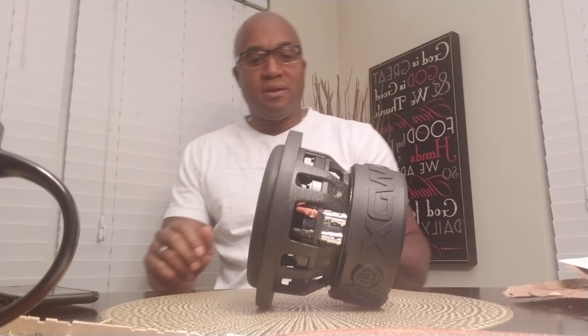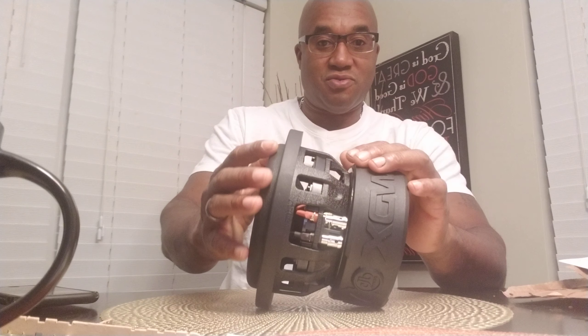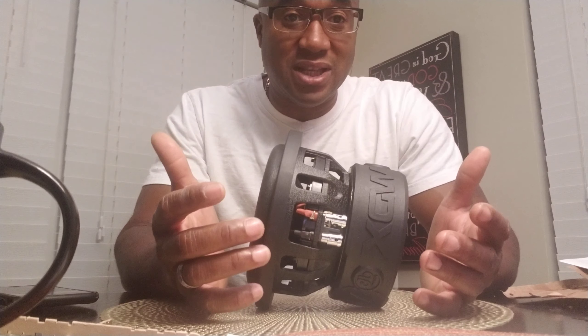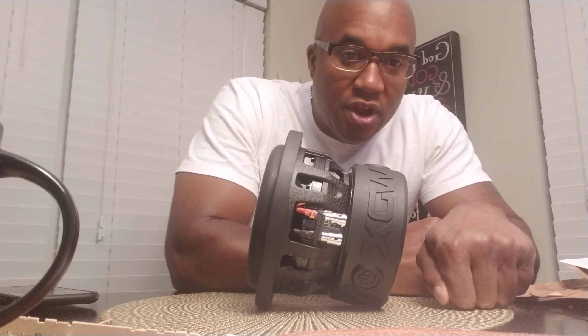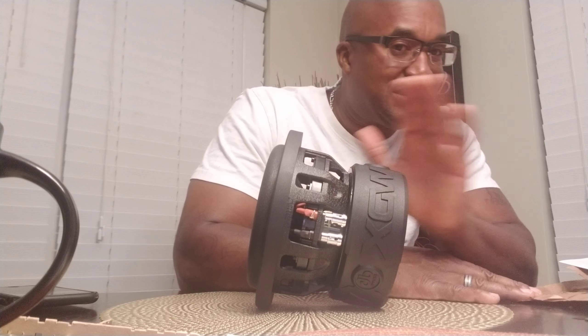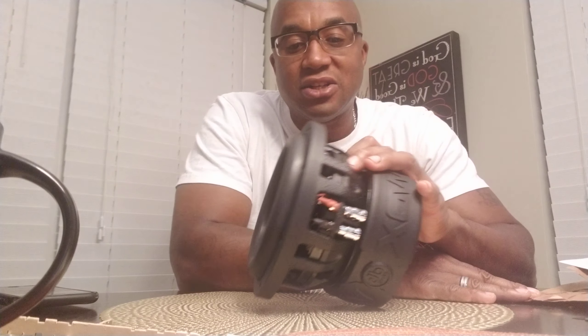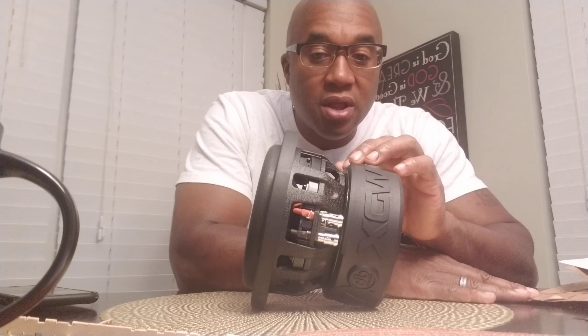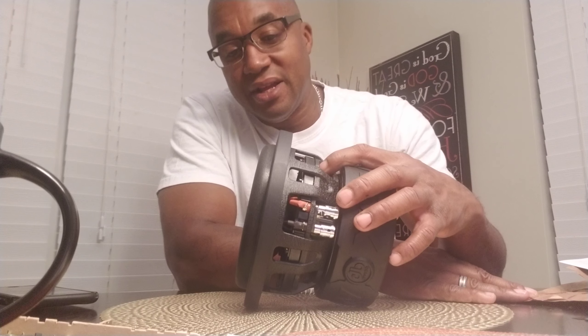Since the Mms is low, the bass won't necessarily be very deep. With the BL around seven, and the motor strength in relation to how light the cone is, this is more SPL-geared. The motor is not all that strong but the soft parts — surround, cone, spider, former, voice coil — are not heavy at all; only about 77 grams. So you're looking at something that will move very very fast. This is best suited for a ported application. Because it's a six and a half inch, it already has a higher Fs — you don't have much cone area, and the spider is going to be a bit smaller.